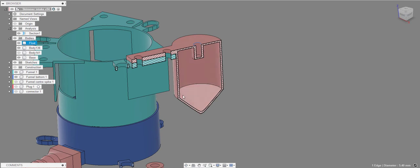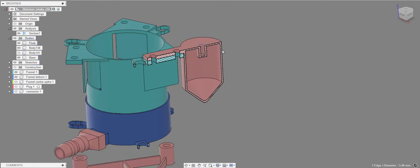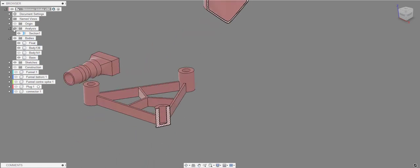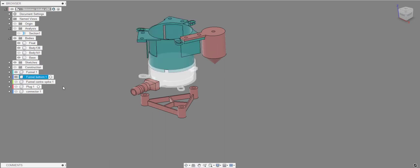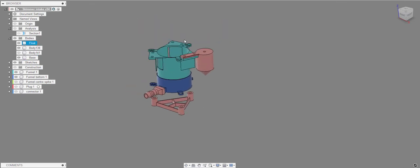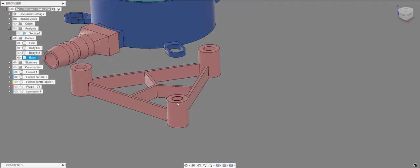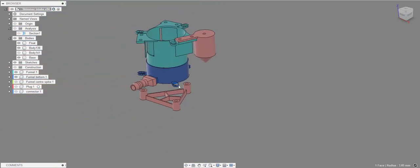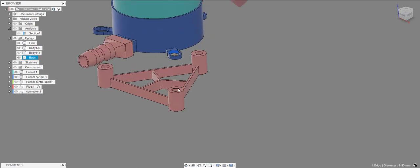If you do get water ingress, just thicken the walls in the design file — I made them as thin as I could get away with so they print faster. Finally, the rod guide base: you print two of these and put one on top and one on the bottom. The rods run up through little loops on the side of the skimmer intake, keeping it moving only up and down without floating around or twisting. They're designed for a 6mm rod.